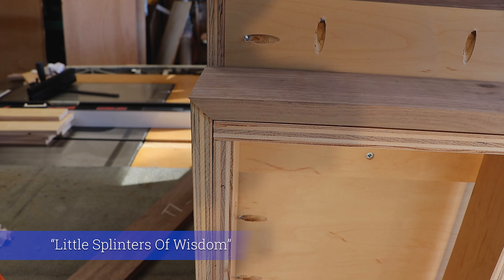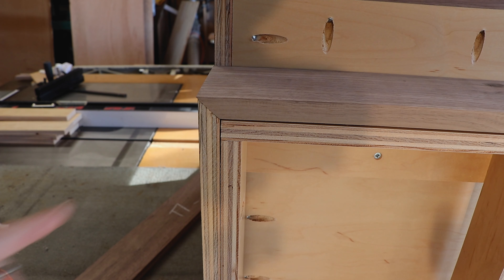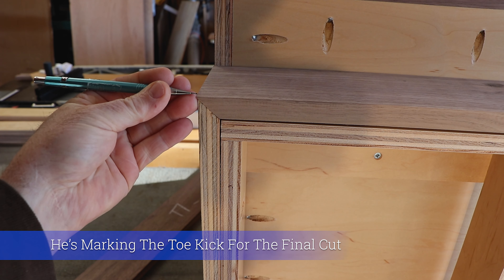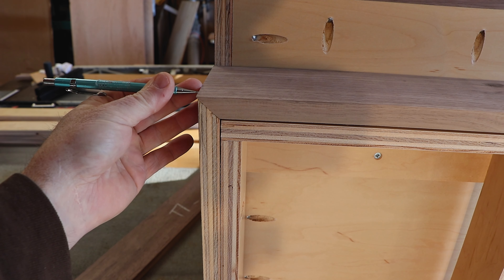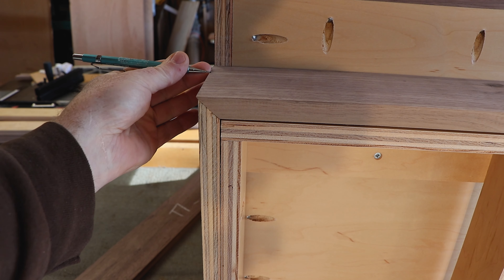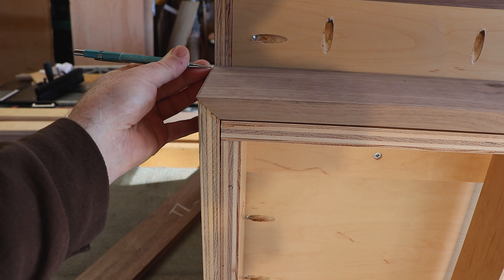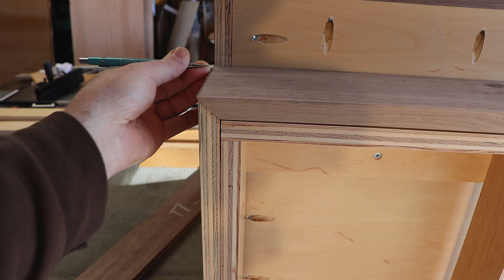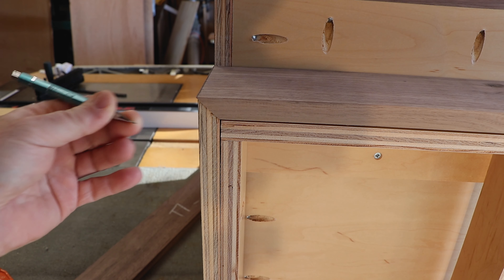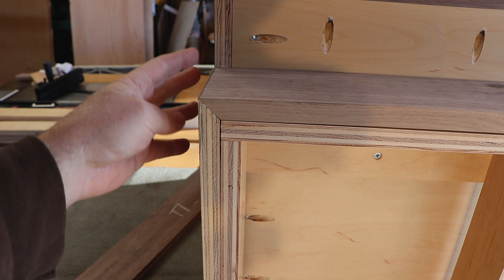So let's say you're mitering your piece and this one's still long and the piece is sticking out. If you want to figure out the length, you can either mark it right here on the edge and carry that over, or what I usually do is put the pencil on the side of the cabinet and use my finger — that'll just translate. You carry that line over, like the middle of your finger. Then carry that line down and cut close to it on your chop saw. I always cut large and fit my way into it.